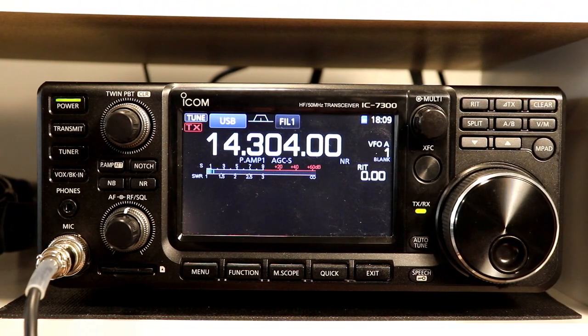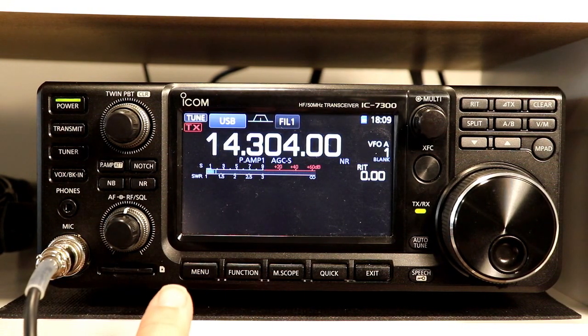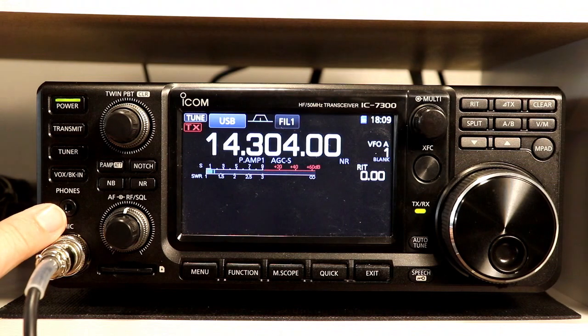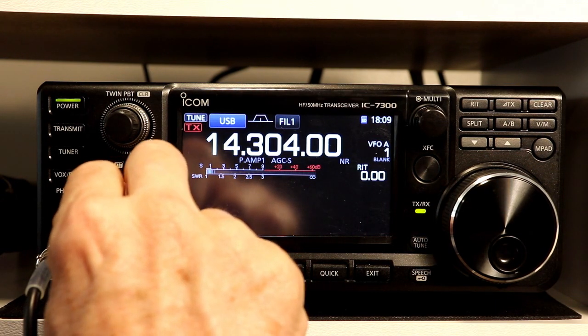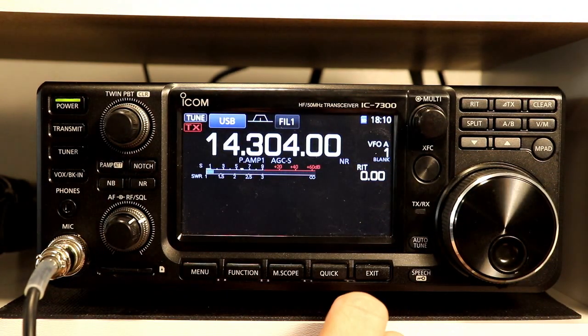Now that we've recorded a contact, let's look at what it looks like to play that back. I'm going to apologize in advance for the audio quality here. Ever since videos 8 and 9 where I showed you how to connect the audio out from this radio to a mixer, I've been using that for all the audio in these videos. One thing I learned preparing for this video is that the recorder playback function on the 7300 does not play back through the line output connector on the back of the radio — it only plays through the speaker on the top or through the headphone jack. So I'm going to turn the audio up and let you listen from the rig.